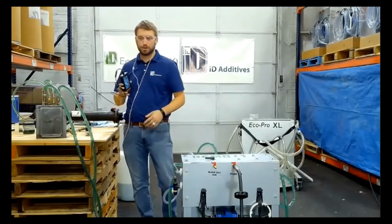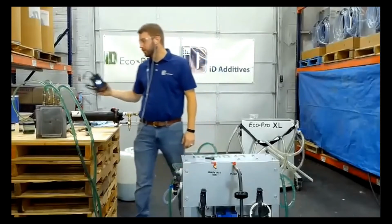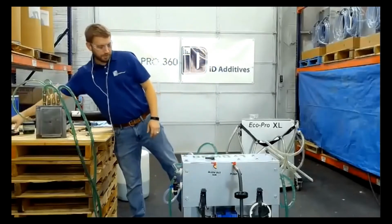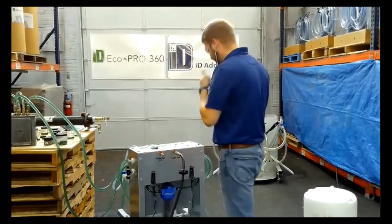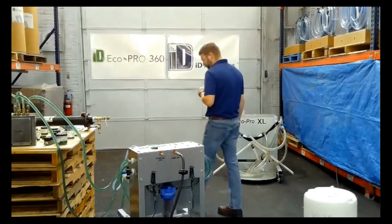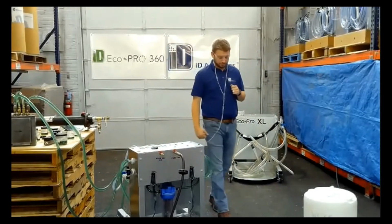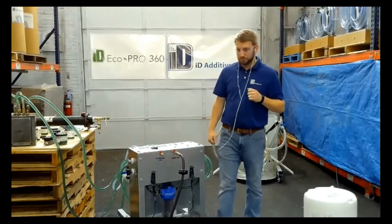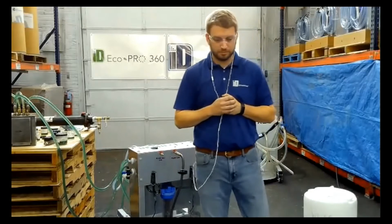I mentioned the bore scope earlier. And you'd be surprised at how gnarly the insides of your lines look. So I'd recommend getting one of those if you can. That number, Brian, that you were mentioning, just so everyone knows, that is an important number, and one that we stress here: 30 thousandths of buildup on a water line reduces the cooling capacity of that line by 60%.